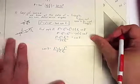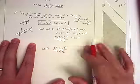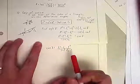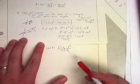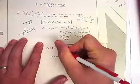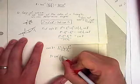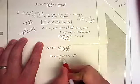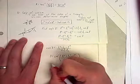If you're interested in where the law of cosines came from, you can look that up online. I'm not going to go through a derivation of that. You can find the law of cosines in our reference sheets that we have in our pack online, but how it derives, I would just leave that to you. So really, gamma is going to be the inverse cosine of all of that: L1 squared plus L2 squared minus L squared, all divided by 2 L1 L2. And then we can put in some values for that.